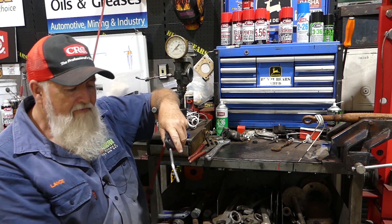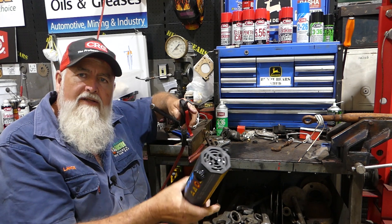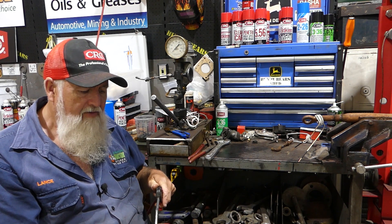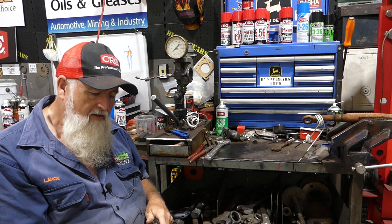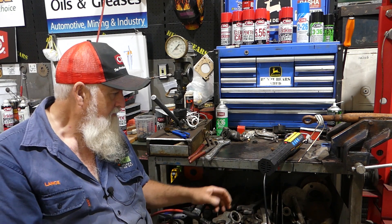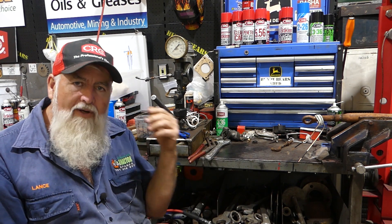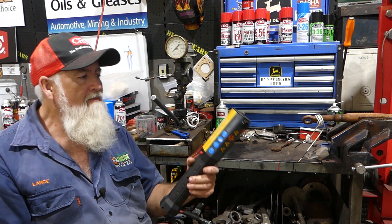I found to increase the time, if you get the air hose and just gently blow it down there — there's a little fan up the end. But as soon as you stop pressing the button, the fan stops working, so when it's at rest the fan doesn't stay on. I found just by giving it a blow it comes back better. It's not made to do 50 dozer track bolts all at once — if you were doing that you'd have an oxy. For getting one loose nut off or something like that, I think it's ideal, with a two minute cycle. But I believe you'd only get a couple of minutes cycle there. When it stopped working at first, I thought I'd broken the thing. I went through the operator's book and the instructions are pretty brief — could be an awful lot better. There's nothing about a reset button, average cycle time, or thermal overload. You just need to let it cool down and you'll get another two or three goes out of it.